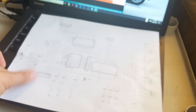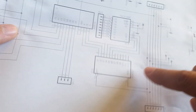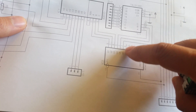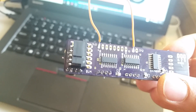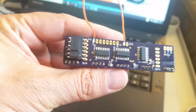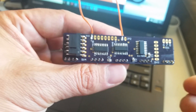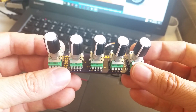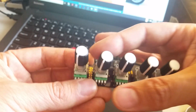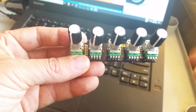How does it work? Basically, you're clocking this chip here, which is a big divider. It uses six pins to control a multiplexer and a 1-of-8 selector. This funny orange wire is actually the selector. You select which board this is by running a jumper from JP2 to one of these pins numbered 1 through 8. These boards are daisy-chainable — you can connect eight of them together, giving you a total of 8 times 8 equals 64 analog inputs. That's five knobs per board for 40, plus you can put three more on each board.